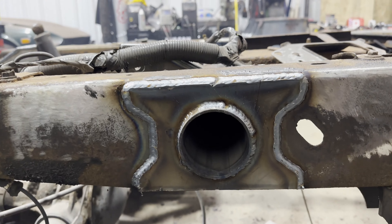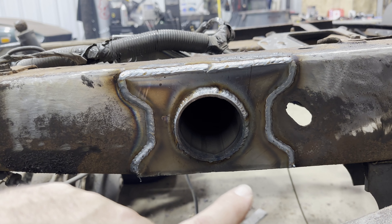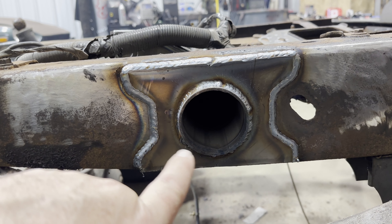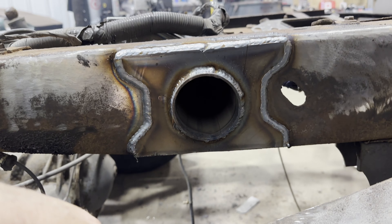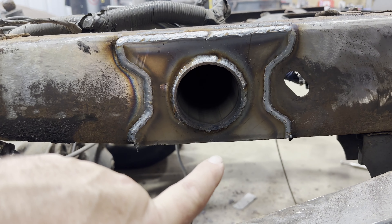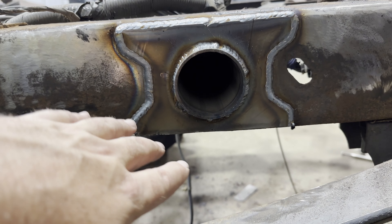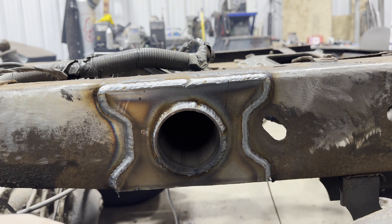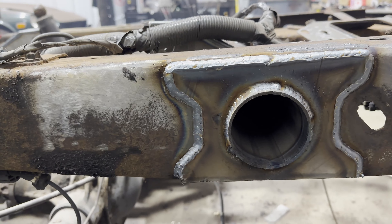Alright guys, here we go. It is completely burned in on both sides, and the one thing you'll notice is there's no weld down here. There's a reason I do that — because inherently at some point in time, there's going to be moisture that gets in behind this plate, and we want that moisture to disappear as fast as possible. Welding on three sides is totally fine as long as everything is pretty stout weld-wise. Leaving the bottom open just allows that moisture that gets inside the frame to get out of there, because we don't want these two panels rusting against each other — it actually rusts quicker when the two metals are against each other and you start getting all sorts of wacky stuff. So I tend to leave those unwelded and let the water drain out of there. It's been perfectly strong for as many years as I've been doing this.